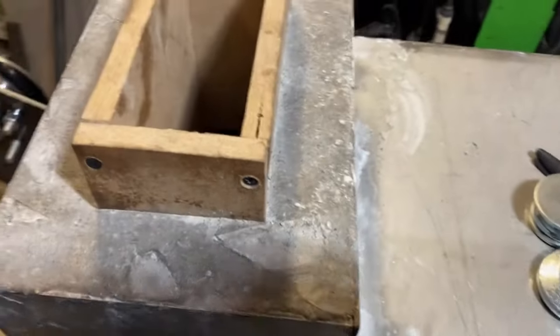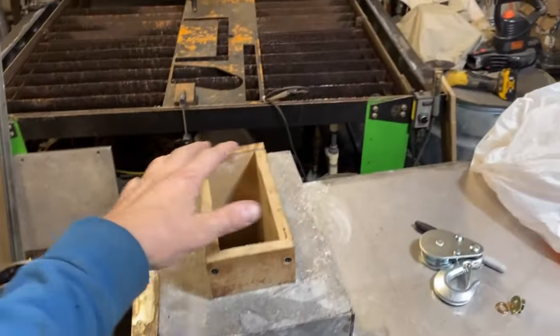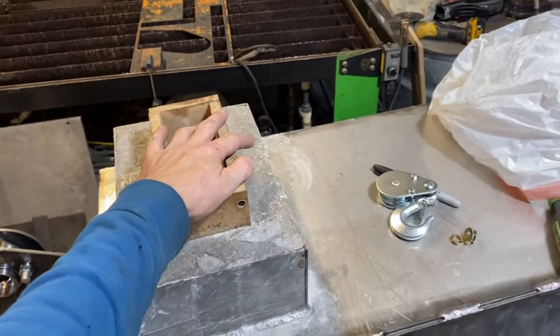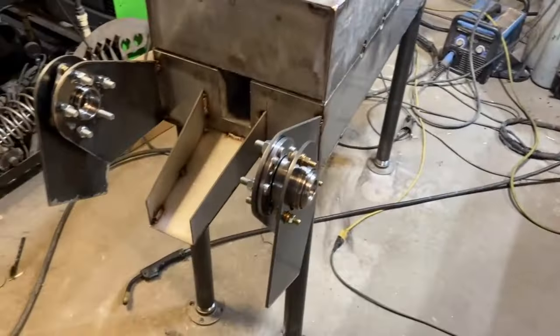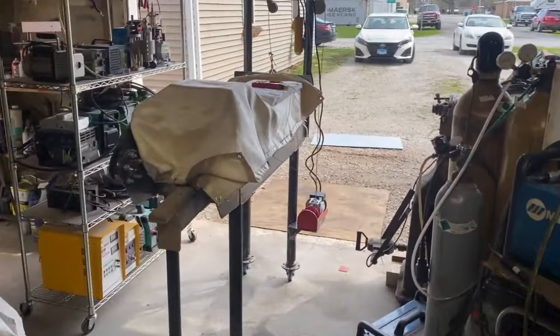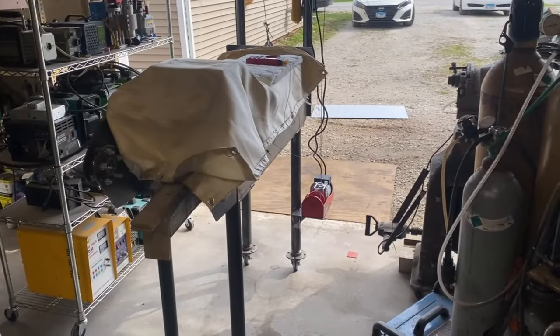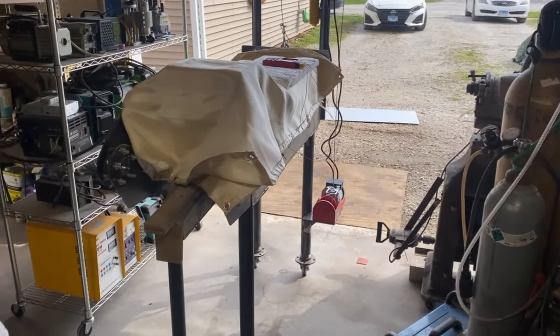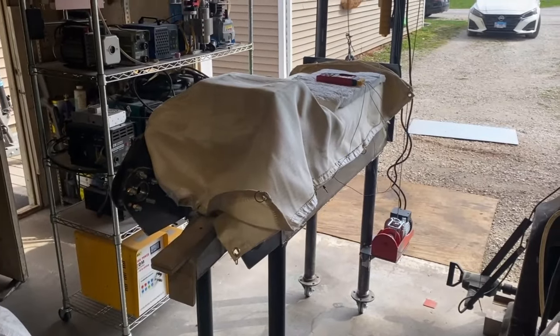And we have no cracks in the top — really nice looking casting. We've had this thing running at 1,000 watts for a couple of days now and it's steadying out at about 350 degrees internal temperature. We may have even removed some of the chemically locked water.